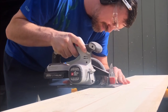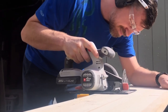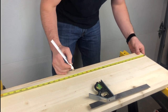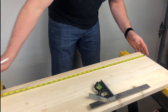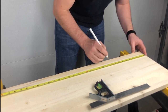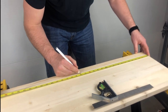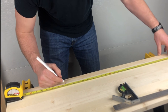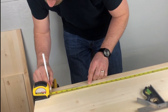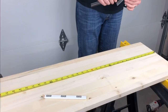Start off by cutting a board down to 36 inches — it's 12 inches wide and three-quarters inch thick. We'll have the dimensions in the description box. We're going to start by marking where the holes will lay out. On our 36-inch piece, start three inches in, make your mark, and then every seven and a half inches: so 10.5, 18, 25.5, and 33 — that leaves three inches at the end.